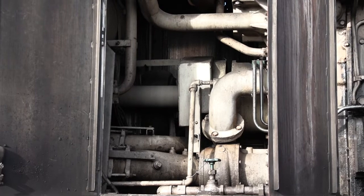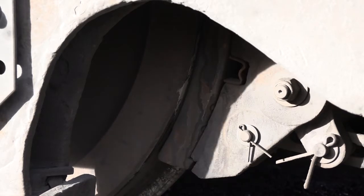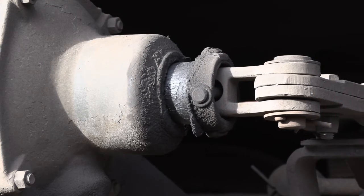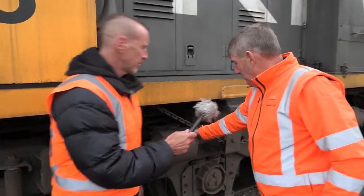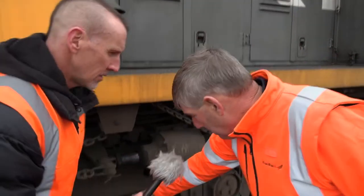Ian's giving you a look inside these powerful DX locomotives at the engine that drives the train. These have also got some serious stopping power in terms of the braking system. On this locomotive in particular, we've got six driving axles. Each axle has two wheels, and so for every wheel on the train, we have a brake cylinder — a total of 12 brake cylinders to control the braking. It's operated by the locomotive engineer in the cab through compressed air and lever operation, which puts the brake pad onto the wheel. This brake cylinder here actually puts the brakes onto the locomotive wheel.